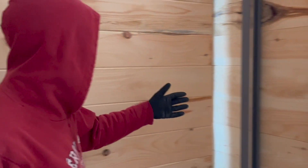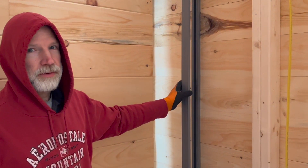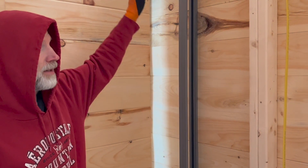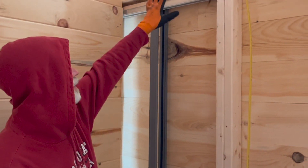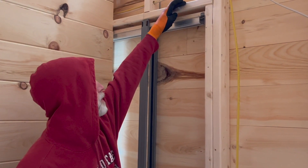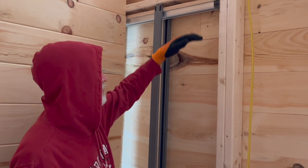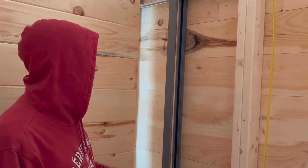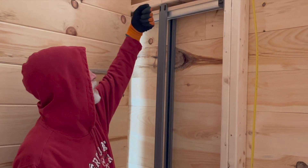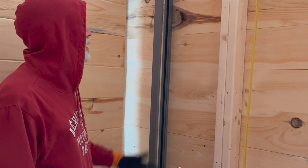Places like the back of this pocket door — if we ever needed to get in here for any reason — it would be very difficult to take a tongue and groove wall down because you'd have to take it down from the top and take it all out. So what I'm going to do is put the tongue and groove wall in, except over here I'll use the boards but cut the tongues off so they're not interlocking. They'll just go in and you'll be able to see little fasteners, but that's not a big deal. That way, if I ever need to get in there, I can take off single boards and get access. I'll do that same thing on the back side of the tub and on our water wall.